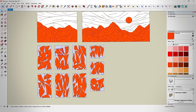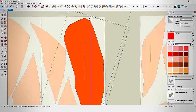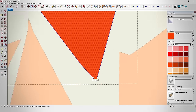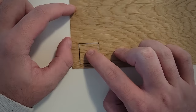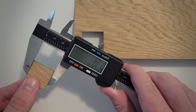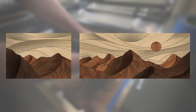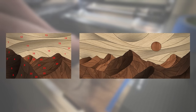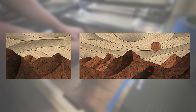For the laser cut file there is one very minor but critical detail. I have all of these individual pieces laid out on the veneer templates matched to the grain orientation I want, but we need to slightly alter all of these parts to account for the laser kerf. Similar to a table saw or band saw, you lose some material — that's the blade thickness removed. For this project it's the laser vaporizing material to cut, so we need to make the pieces slightly larger on all sides to make up for that 1/64th of an inch lost. With over a hundred pieces that all need to come together, that minuscule error can compound very quickly into a real problem if not addressed.